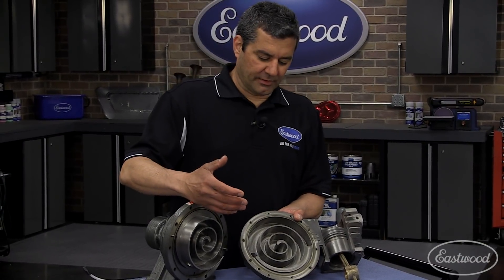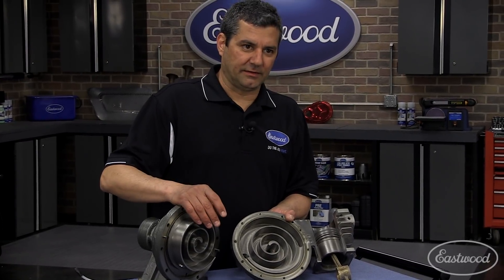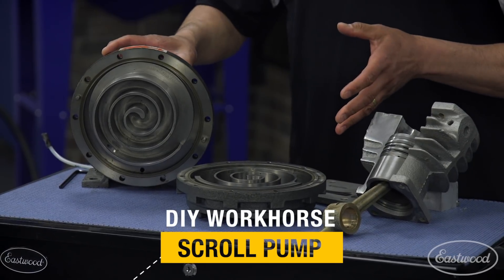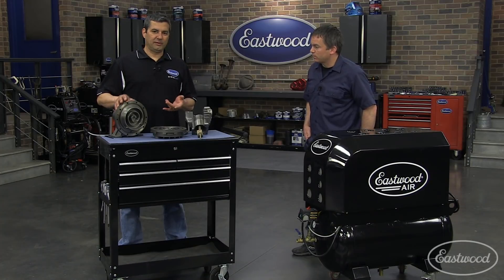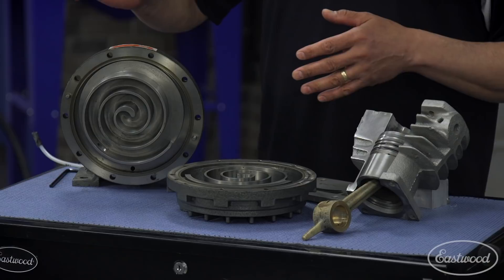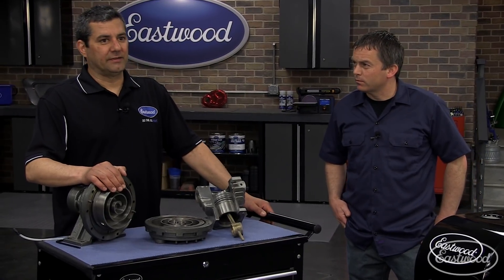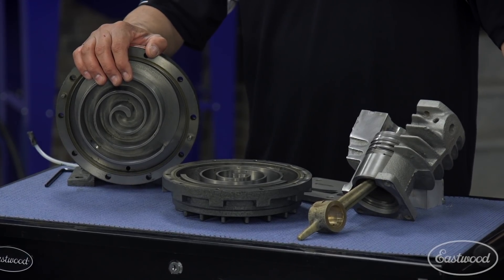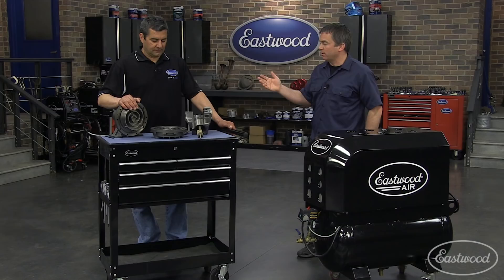We use a premium synthetic oil in here, which takes up that difference and creates the airtight seal. So these are designed to run constantly — spin it up to about 3,000 RPM and just let it run all day long. It'll put out the same PSI, same CFM, from start of the day to end of the day. We warranty these units at 100,000 hours. So if you're using this two hours a day, 300 days a year, it's a long time — it's like a lifetime. And it's because there's very few moving parts and an oil barrier.